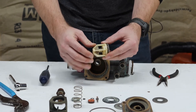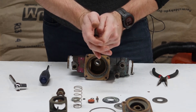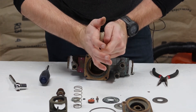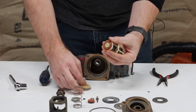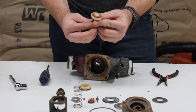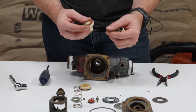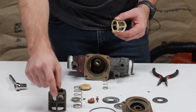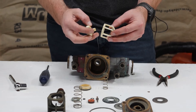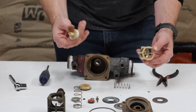Just like other backflows, your number one is larger than your number two. To take the check apart, push it on your palm for a hold, give it a nice hard turn — sometimes it's tough, so push together a little tight and turn with your palm. It is spring-loaded so it's going to come apart. This rubber typically comes in a set — the whole thing. You can try to flip it but you run the risk of ripping it and still having a problem. These cages also get brittle, so before you pull this apart always have a kit. I can't tell you how many times I've cracked one of these and been stuck. So there's your spring and your checks.